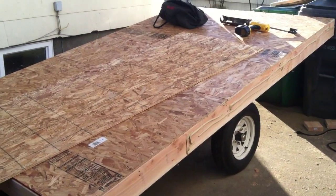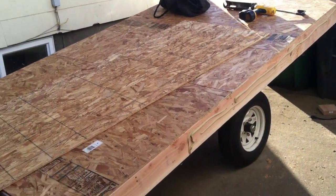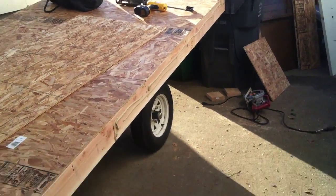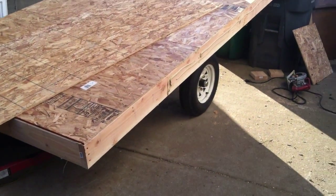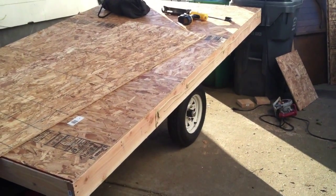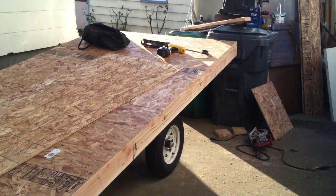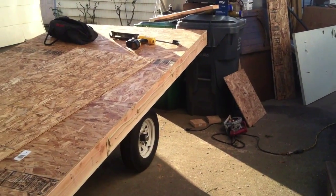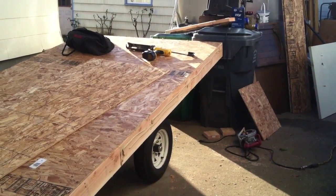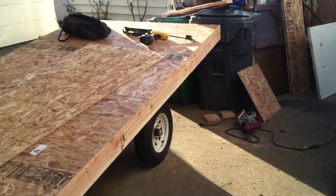Normally at this stage, with a good solid deck and the glue curing, if it were a building you would start putting your framing on. But here's where I cheat — and this is why you can cheat on small structures using OSB or plywood sheathing. Because I have this good six-inch wide base, I'm going to attach the exterior sheathing first. It's going to be rigid enough that it gives me something to attach framing to. We'll get a few screws on the side, attach the sheathing first, and then the wall goes in immediately afterward.